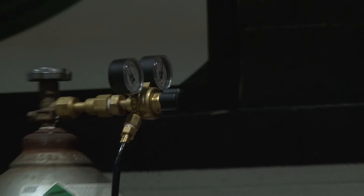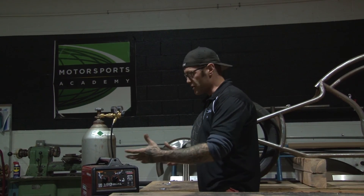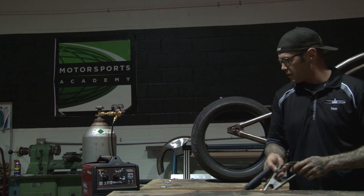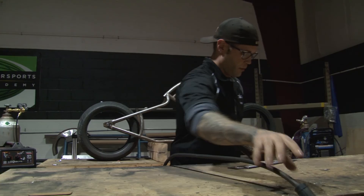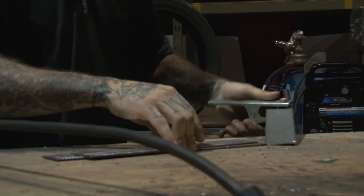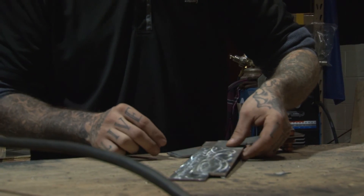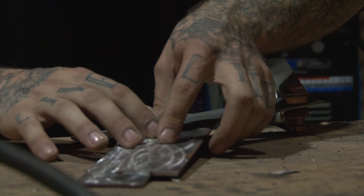We want to make sure the PSI is no more than 25. So we're going to bring this down a tad, fire up our welder — and in our other segments I go through the duty cycle of welders, so make sure you check those out. We're going to bring out our two leads, and make sure we have a nice ground. I'm going to use another piece of metal, ground that over here, and lay our pieces of metal on top of that, so the clamp doesn't interfere with any surface areas and distort it.